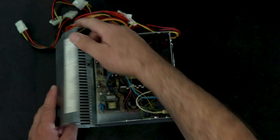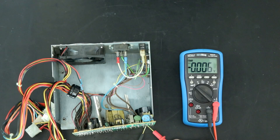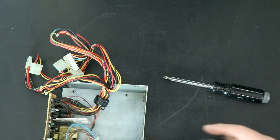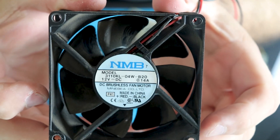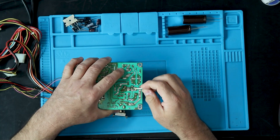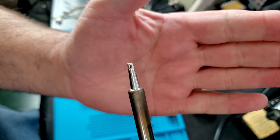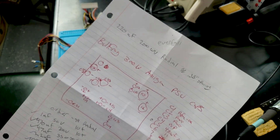A few days later my cap orders came in, so it's time to pull the power supply back open for a full restoration. I quickly made sure the caps were not charged, then pulled the board out of the PSU for better access. The fan looked like it had been replaced at some point, so I connected it to the bench power supply for a quick test — it sounds really good. Since the replacement fan I ordered was defective, I opted to clean and reuse this one. After brushing out loose dust with a slightly dampened detailing brush to prevent static, I add a little flux and fresh solder to each cap's contacts before removing them. I had to change to a heavier iron tip for extra thermal mass on the heavy ground plane. I'd already made a detailed list of each cap's position, value, and polarity.